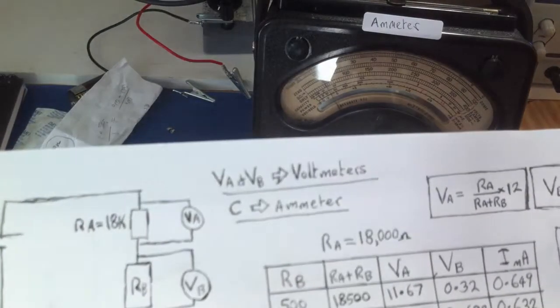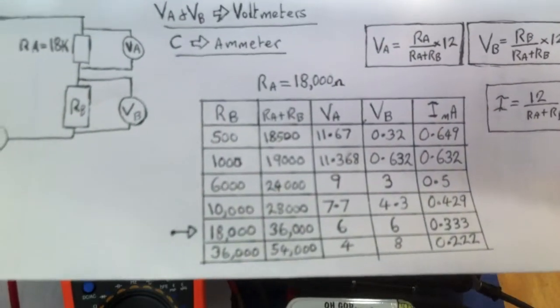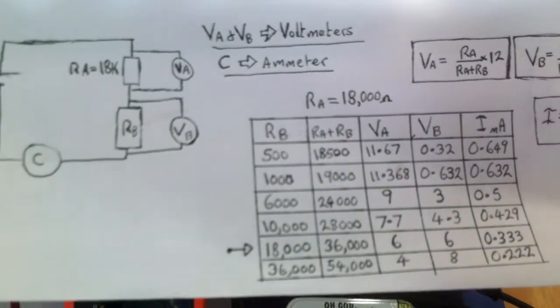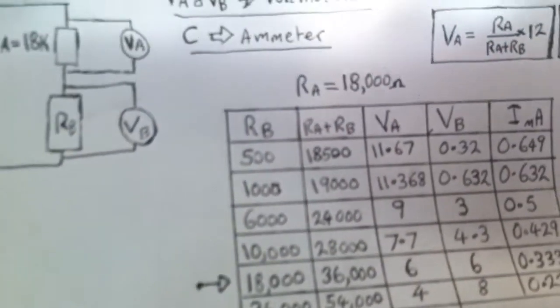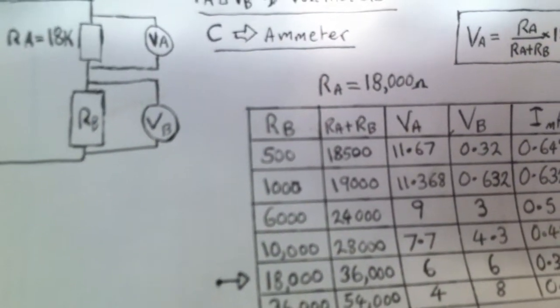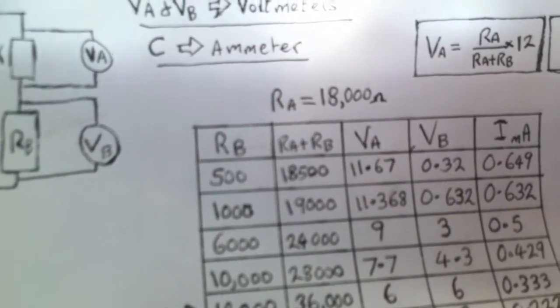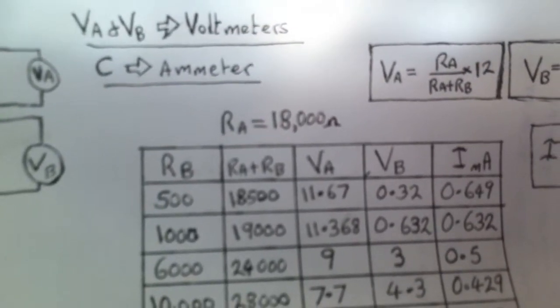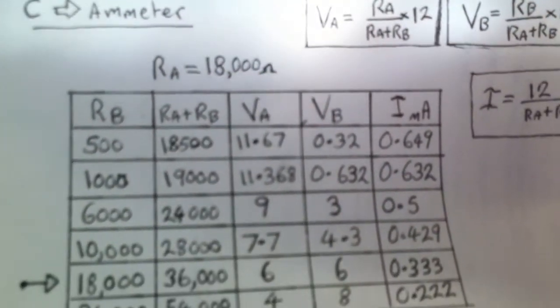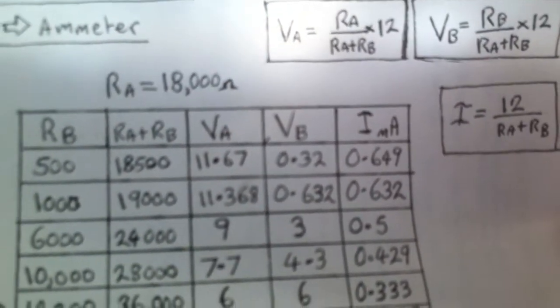Okay, we'll go with, in the actual last video we showed, 6,000 and 18,000. So let's do that one now, which is that one in the middle there. You can say 6,000. If we add 6,000 to 18,000, we get the total resistance, which is 24,000. We should see 9 volts across the fixed resistor and 3 volts across the decade box, and the current should show 0.5 milliamps. So let's just check that.